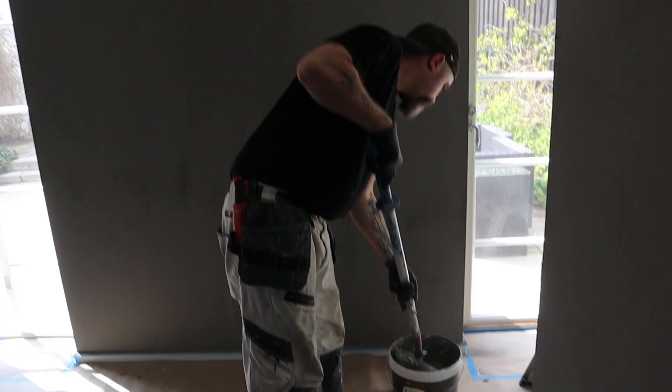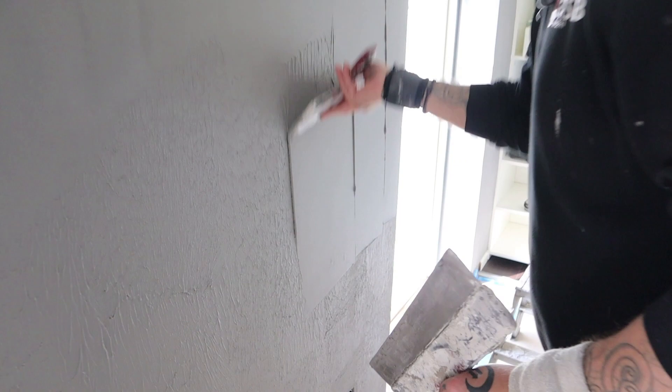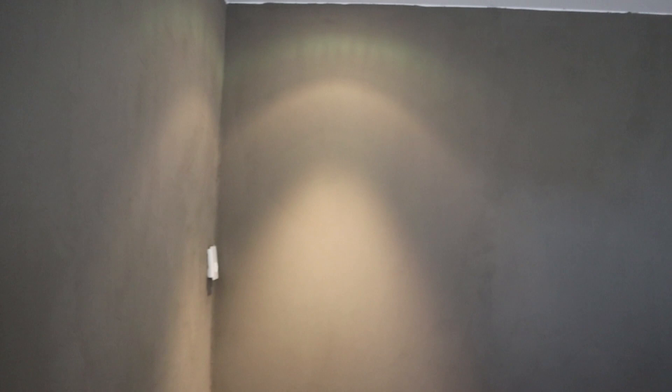It's not a consumer product, and if it's a very high ceiling then you're basically stuck. It dries very quickly when you're working it — you have to be very efficient. One person needs to apply it to the walls and the other has to go over with a spackle straight away afterwards, otherwise it starts tacking off. Basically you just roll on about a meter at a time and then start spackling it out to get that effect. All in all, I am absolutely delighted with the finish. It's a product I would use at home because the lime wash effect is just class — I love it, I'm totally sold on it.